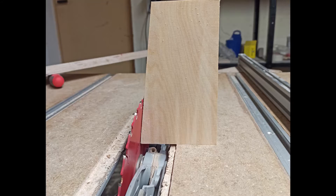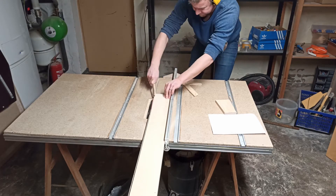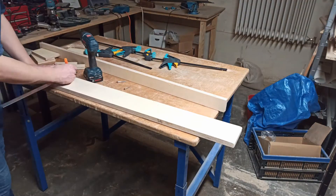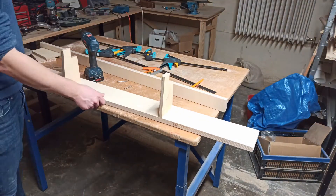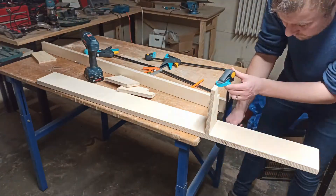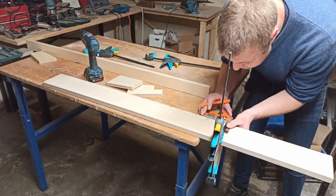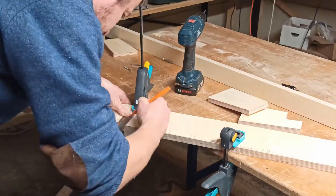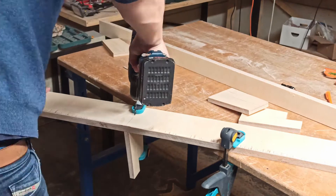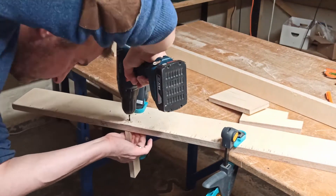For cutting the two long parts, a table saw is useful, especially for the beveled front side of the one that is attached to the ribs. This is to give maximum support to the lower side of the track and prevent the wood from wobbling around. The long parts should be as long as you need to give enough support to the rail and not be shorter than the plywood you want to cut with this jig.